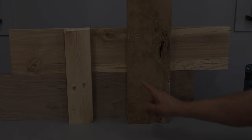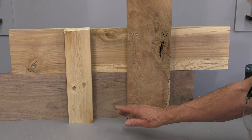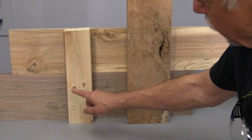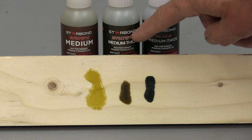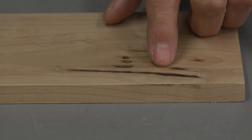Here are a variety of four different woods — fir, alder, walnut, and maple — and all of them have knots in common. You'll notice that in every case the knots are all darker than the wood they grow on. The rule of thumb when filling voids or knots is to always go darker than the wood they're sitting on. For filling knot holes and cracks, Starbond has three products you would typically choose: a medium which is a light brown, a medium thick which is a medium brown, and a black.